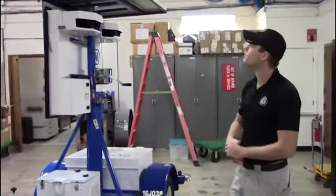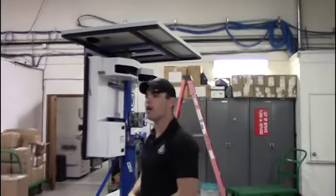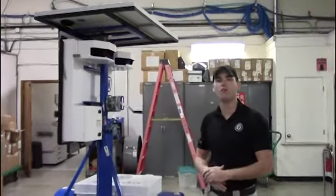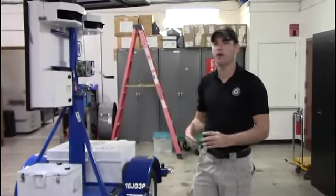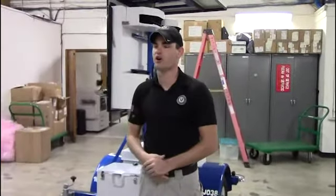As far as an overview of the trailer: you've got two 85-watt solar panels, so 170 watts of solar total. You've got three sealed 200-amp-hour batteries in the back — zero maintenance required with those batteries, no filling with distilled water. And you've got a 55-amp battery charger in the back.